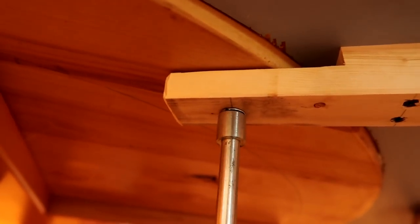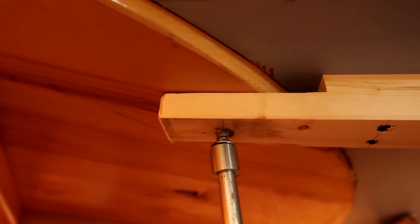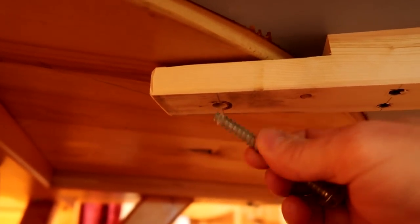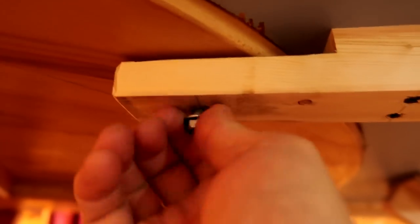There is a screw right here which fits into this thing here, and that latches the whole table up against the extension when I'm putting it away. And it attaches with these big quarter inch wood screws, which I do need a nut driver to get on and off, like this. And the holes for these, I just tap with a homemade wood thread tap, and that makes the screws relatively easy to get in, so that I can actually twist it most of the way in there by hand.